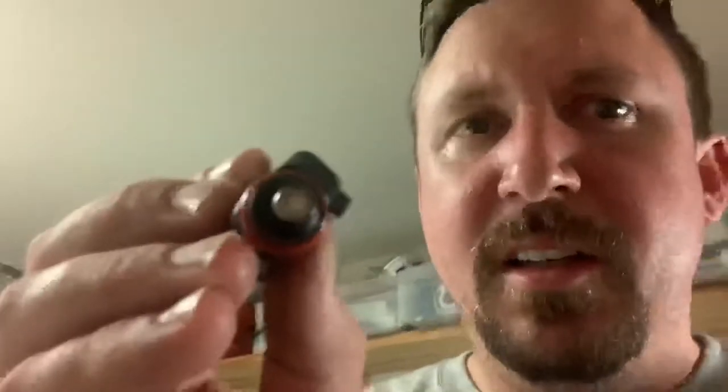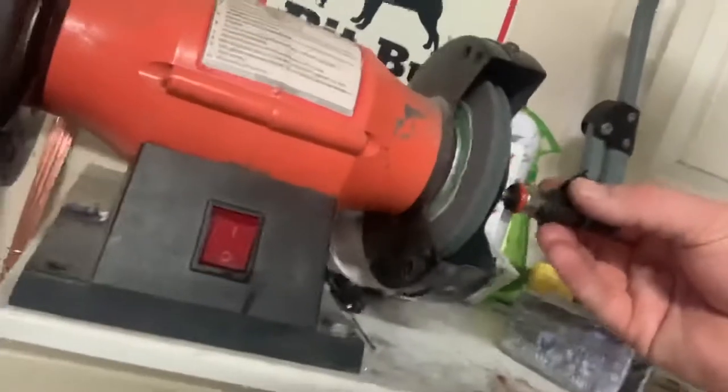What I figured out — I tried just dissecting one. I have one over here that I just totally grinded and tore apart, to the point that it was totally ruined. I learned how they're put together. Basically, if I just take a stock injector and hold the tip — the normal capped tip — nice and flush on my grinder, and just grind away that material until you can just see the pintle, the round little pintle valve. That seems to work pretty good.